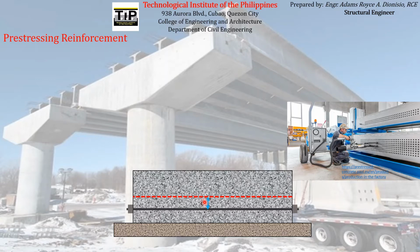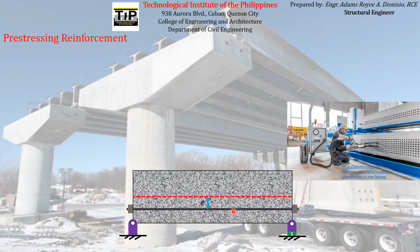Because of that compressive force being applied by the pre-stressing reinforcement to the concrete element, the beam or the concrete element tends to bend upward. When it bends upward, it will look something like a simply supported beam. And after that, since it will be a simply supported beam already, that will force the concrete element to support its own weight. Then after that, the service load will be applied to the concrete element.